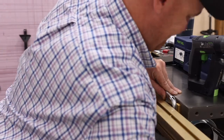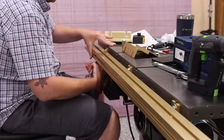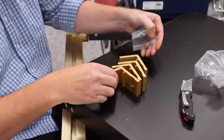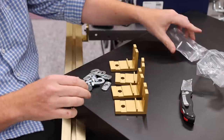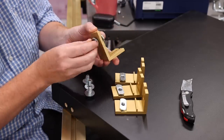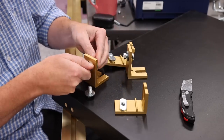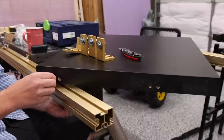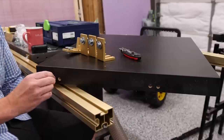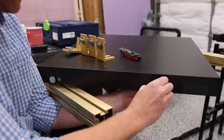After all of the brackets were tight, I go back and tighten the bolts on the underside of the rail to lock everything in place. If you plan on using the existing extension table on the SawStop, do yourself a favor and buy some additional brackets. I ordered four additional brackets because you need it to be aligned with the cast iron surface. Without the extra brackets, no matter what combination I tried, I kept running into alignment issues. So I went back to Incra's website, spent about $40, and got the additional brackets. This made the install a million times easier.